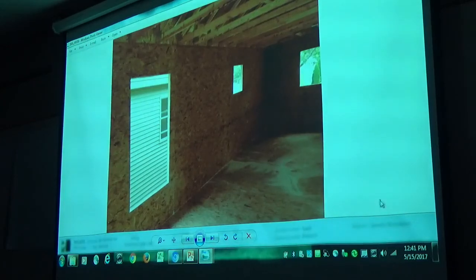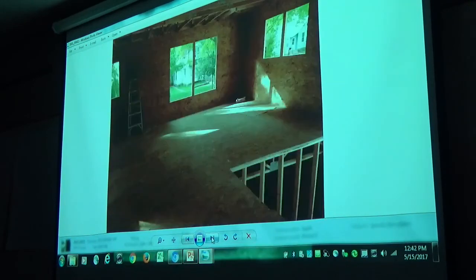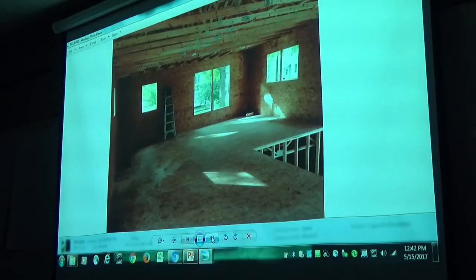So then when you get up into that finish before interior walls, you've got this wide open floor plan, all the windows are cut out, stairwell is cut out, and at that point, you either got a ladder in that stairwell opening, or you can start framing out that interior stairwell. In the case with Habitat, we'll have all the interior walls already framed, and it's just a matter of standing them, laying out snapping lines and standing them, tacking them in place. Right? Or you could just have one big open room, and that's a design you could do.